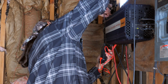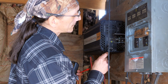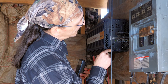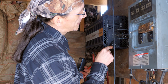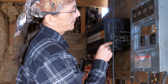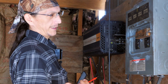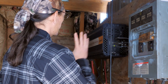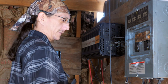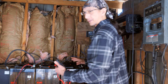Here on the inverter display you can see the battery voltage coming in. When the fridge kicks on, it turns orange — it doesn't like it — and if there's an amp overload, this screams and goes red and the whole inverter shuts off. This is the main switch to turn it off. To switch from battery bank to generator, we flip this switch to shut the battery bank down to the house, flip these, close this, open that, turn on the generator, and then we're running on generator power.